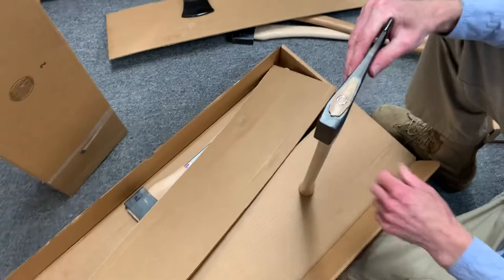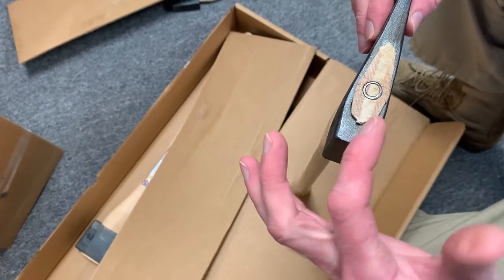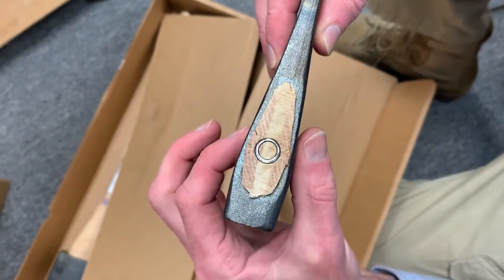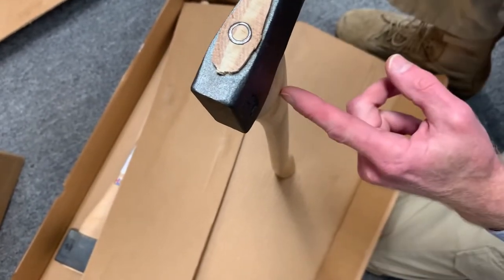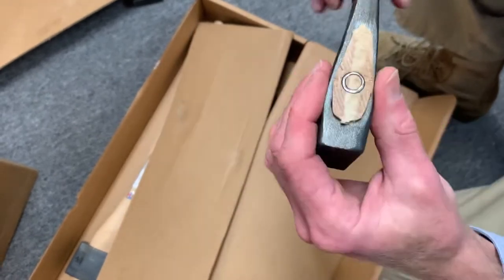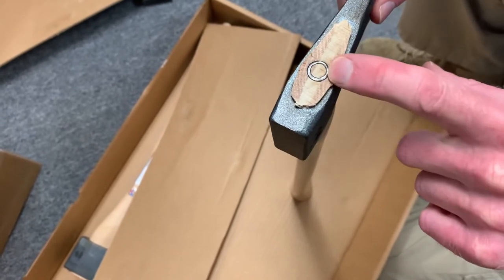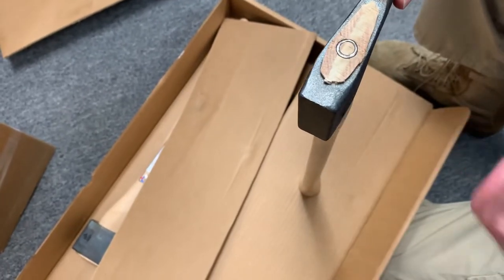One thing I don't like that Council Tool does — I don't like these round wedges. On an axe this small it doesn't even need a metal wedge; the metal wedge will keep the wood wedge from coming out, but so would glue. These little cracks you see almost never matter — it's not like leaving it out in the rain is going to let water in and rot. I only know of one example where it went all the way through. In a factory environment, a flat wedge is harder to get started straight, but the round one presses in much faster — that's why they use them on the cheaper ones. They tried round wedges once on the more expensive ones but went back to flat because people prefer it and it costs more.